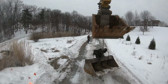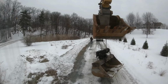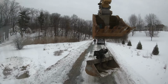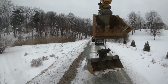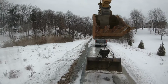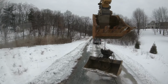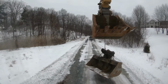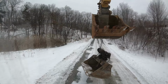Not like someone's gonna take it. Quite heavy. We'll track this up. Everything seems tight in that coupler up there. Usually they'll shake pretty good. I know it's got new pins in the bucket, but the coupler itself looks like it's all pinned and bushed because it's just doing its normal sliding back and forth, which is normal. It's when they go up and down. All right, let's turn this thing up. She's a fast little cookie.